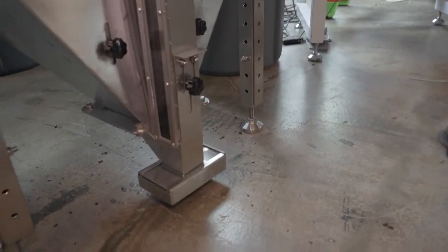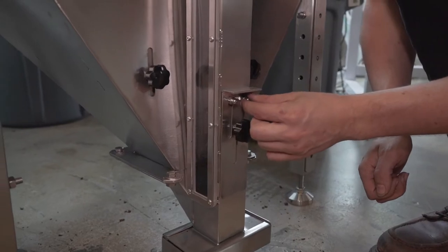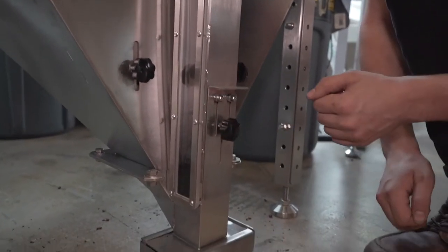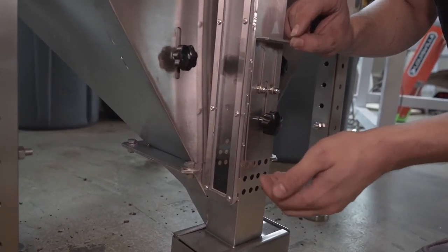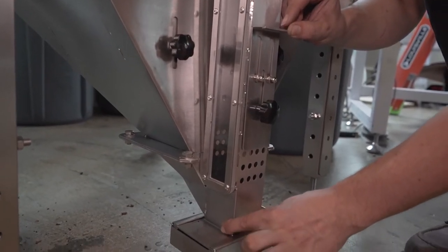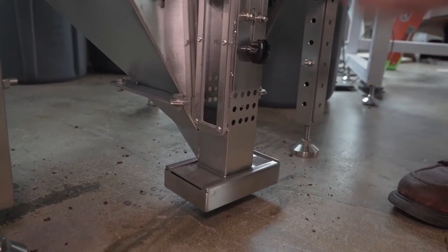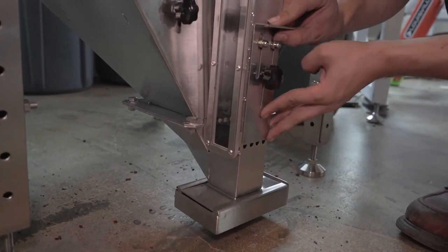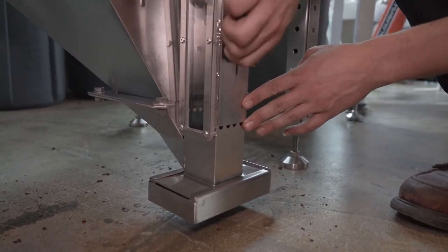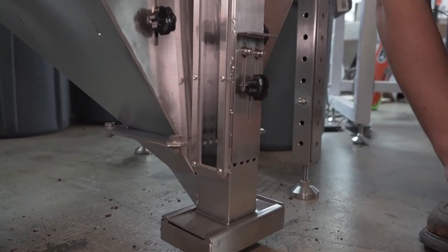The air riser is this piece right up here in front of the machine. It might look a little different depending on the machine that you've got. Basically you're just going to loosen the nuts up top so that they provide a little friction but aren't tight on it, then go ahead, loosen that finger nut and you're able to just slide this up. We've got these lines of holes here, and what that lets you do is increase the airflow, which decreases the density even a little bit more down here. The beans can still come up, flow through, and then they get a little burst of air here to keep them going. But anything heavier is actually in a lower density space down in the bottom and it's more likely to stay down. We recommend doing just a half row at a time until you get your best results. And if you start finding that you're doing this and now it's getting worse, you've hit the sweet spot and you should start working back.